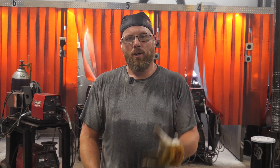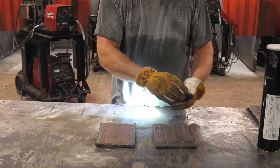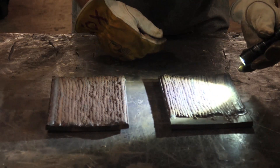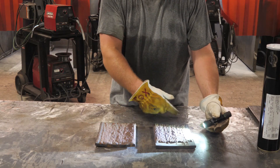It was a hot and muggy day here in the shop doing some pad welding in all positions — flat, horizontal, vertical, and overhead. Hopefully it's helped some of you new welders with all the tips and tricks I've given. If you're a veteran welder and you agree or disagree with something I've said, please comment below — I'd love to hear some feedback. As you can see, this is a great running rod. If you look at my pad welding, it came out really smooth for left-handed, right-handed, left to right, near to far, far to near, with lots of starts and stops using stubs. My out-of-position horizontal, left-handed and right-handed, came out pretty good. My left-handed vertical could use a little work — got a big hump where I had one start that was not great. And then the overhead came out really smooth.